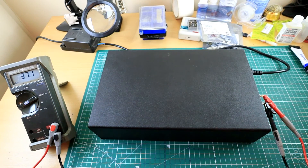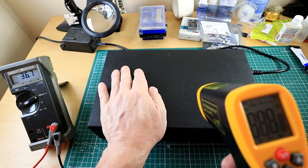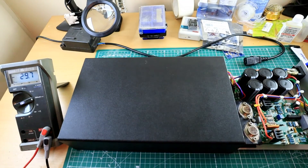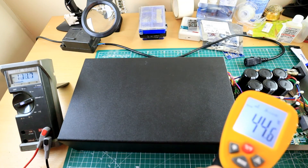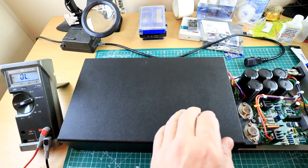I'm going to check what the bias setting is right now. I need to power it down — it's 35 degrees at the moment. I'll unplug and slide the chassis out. Now we can see the output transistors are at 45 degrees — 44 to 45 degrees. It just goes to show how the heat builds up inside the case. This is quite warm to the touch. I'm just waiting for it to decay a little.